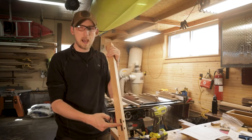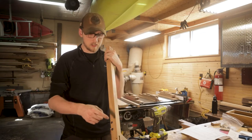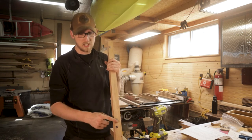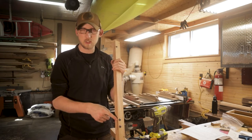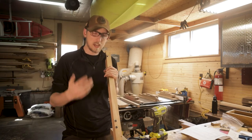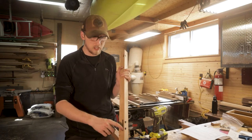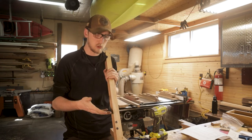The other thing I would do is move my mortises back closer to the middle of these pieces rather than where they are now. In my plans I had them right in the middle of these boards, same as the rest of our mortises, but I would also go back and inset these heads so they'd be flush with the surface. It's a little too late to do that now because we're only a quarter inch away, and these heads are about an eighth of an inch thick — that would only leave an eighth of an inch of material, which would probably break. But they do go in there, they hold nicely, they don't come out, and you need an Allen wrench to get them out, which is exactly what you want. When I get those tenons fitted up I'll drill those holes with a clearance bit and make them work just as nicely.